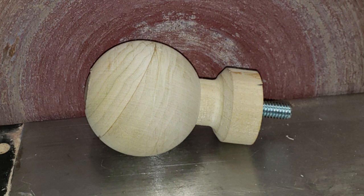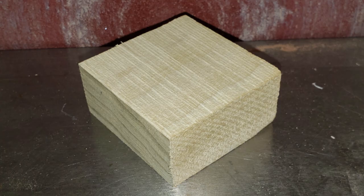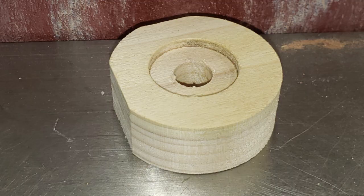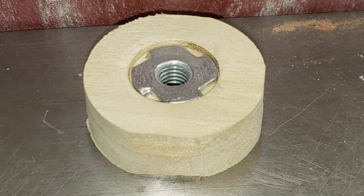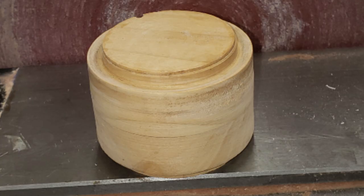Insert the bolt and add some CA or hot melt glue around the hex head to prevent rotation. To make your work platform, double stick tape one piece of wood to another faceplate and rough round. Drill a large hole and a smaller hole to fit the T-nut — the T-nut must be completely encased in the wood. Press or hammer the T-nut into place. Glue the other piece of wood to cover and encase the large end of the T-nut. Let harden, then mount to the auxiliary faceplate and trim to round and face off the surface.